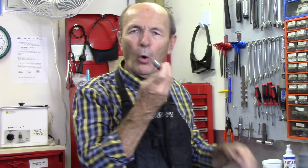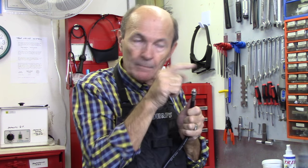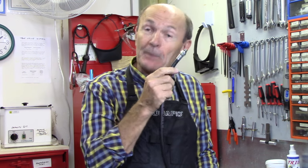So why not today? Well, today they made the hole very, very small. In fact, if you look down in the high-pressure port in a modern regulator, you'll see that the hole coming out of the regulator is very small too. What does that mean? Well, not much air can get through it. It's so small, it's restricted. So if you had the tank turned on and this hose blew, air would come out. Something's wrong. You turn it off. No big deal. No more whipping. No more danger. So they've actually made the fitting on the end very, very small, and the opening from the high-pressure port very, very small. So now if a high-pressure hose breaks, that's not a danger anymore.